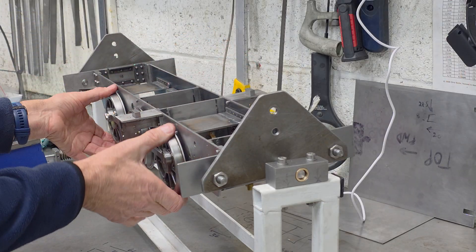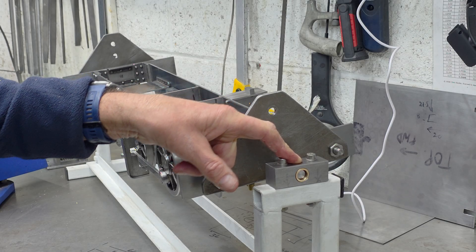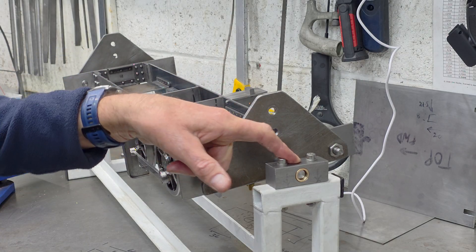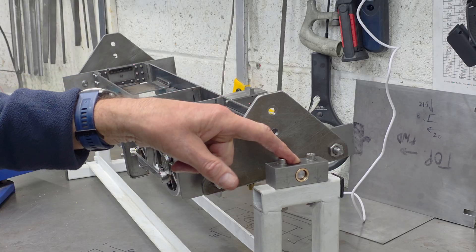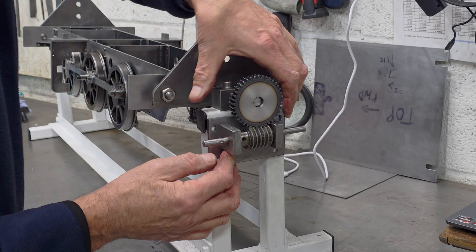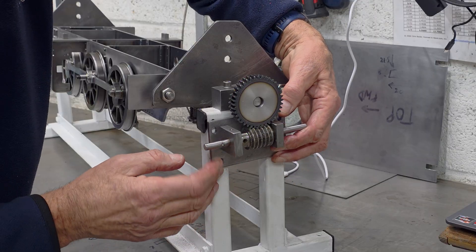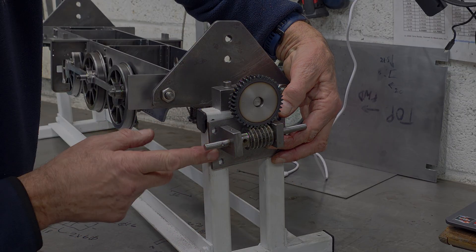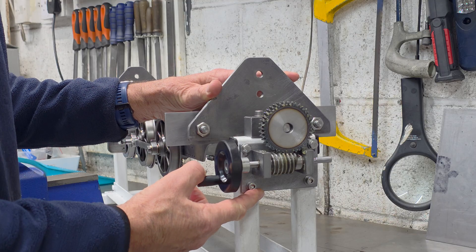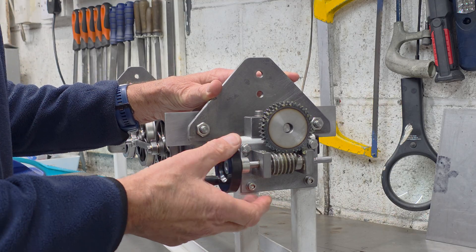After spending some time to loosen up those connecting rods: these bearings are a little bit lower than the previous ones, so I need to move the worm gear lower on the far bracket. I'm also going to drill an oil hole in each of the bearings so I can get some oil down in them. Not that they really need it, but it'll only take a few minutes, so why not? It'd be good if I can reuse this bracket, although I will need to put some new bolt holes in the base plate.